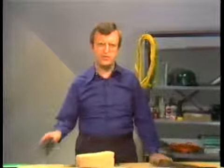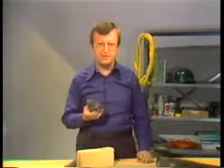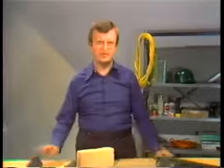Now, the third problem affecting water walls is excessive ash accumulation. This can be plainly seen by looking at the water walls. There are two kinds of ash accumulation to look for: ash that adheres to the entire water wall and clinkers that are fused to it. Now, clinkers are dangerous since they're large and they can hurt someone if they fall. Be sure to clean them away before working inside the boiler.